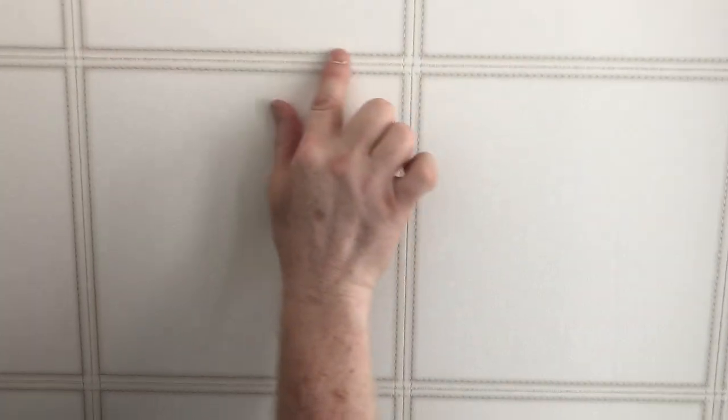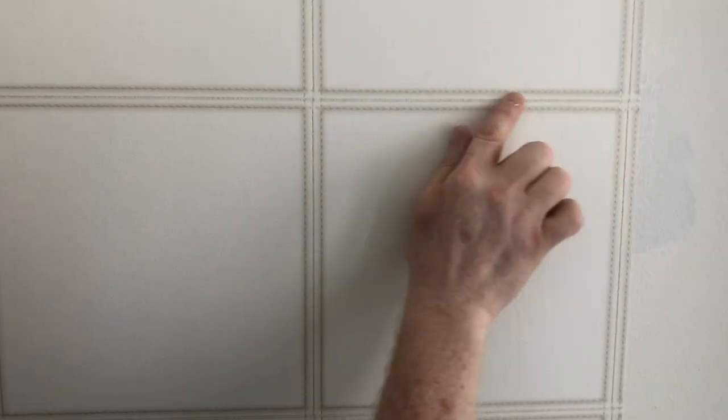Look at the beautiful finish on this. This is called Stitched Leather by Brash — it's a product from the UK. Isn't that lovely? Now look at my seam here. You want to always make sure there's no sticky on your smoother. I'm holding this at about a 25-degree angle and just pushing up. I checked to see if I oozed out any glue, which I did not.